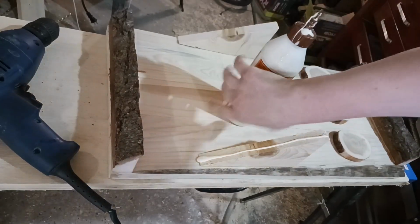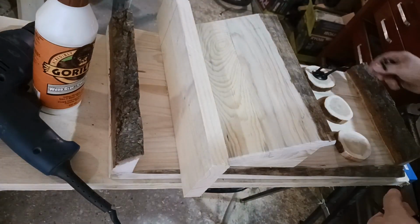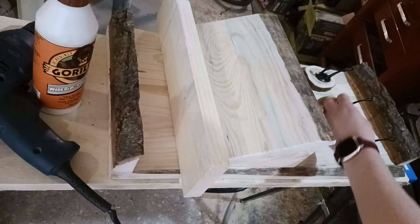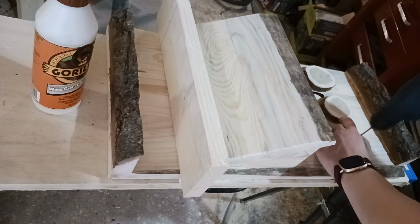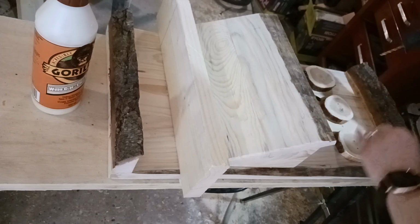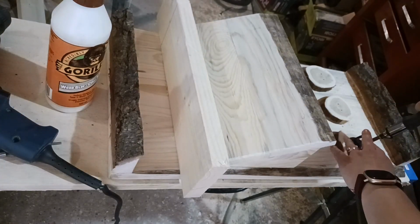Next, I move on to attaching the front of the letterbox, again repeating the previous steps. I held it steady with the same board and then I allowed it to dry. While I waited, I attached the hooks. I marked out the holes in the hardware using a pen. Then I removed the hooks and drilled into the marks I had made. Then I replaced the hooks and tightened the screws in using a screwdriver for more precision.